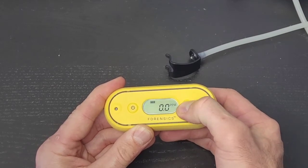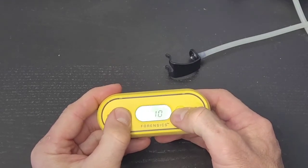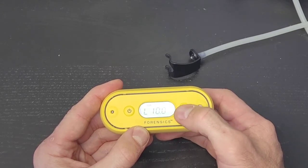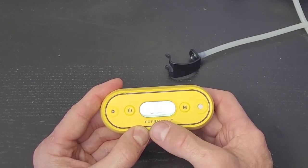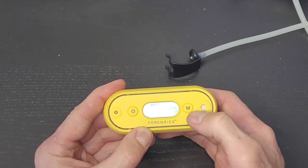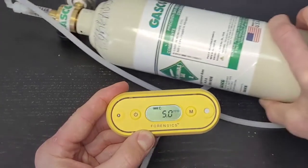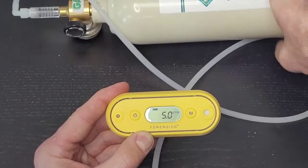To access the advanced menu, hold down the M button and enter the password: 1, 2, 3, 4. Anytime you hold down the M button, that means enter. The first option is L — low alarm. Press again for H — high alarm. Default is 10 ppm for low alarm and 20 ppm for high alarm. Press again for Z — zeroing. Press again for C — calibration. We do want to calibrate, so hold down menu. It's asking: is 5 ppm your calibration level? In this case, it absolutely is, because we're using 5 ppm of carbon monoxide to calibrate.